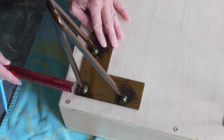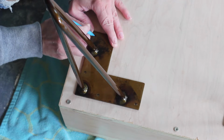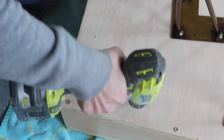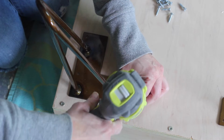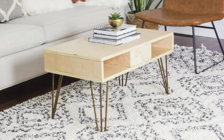I received these hairpin legs from a company called DIY Hairpin Legs, and I will link to them in the description box along with the specifications of the legs that I used. I spaced them 1 inch away from each edge, pre-drilled pilot holes, and screwed them on. I did end up having to use shorter screws than the ones they came with since I'm working with thinner material. And that's it.